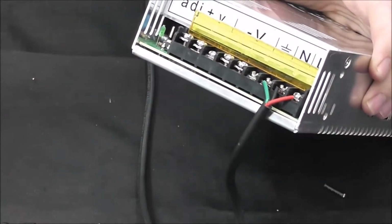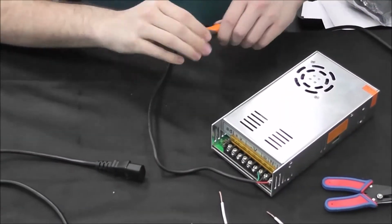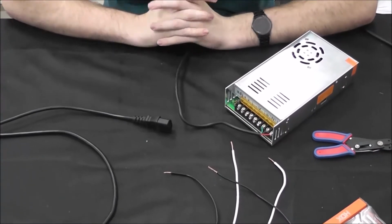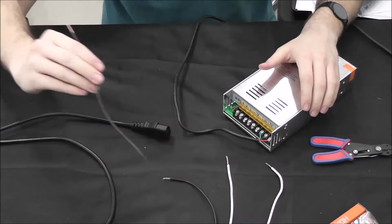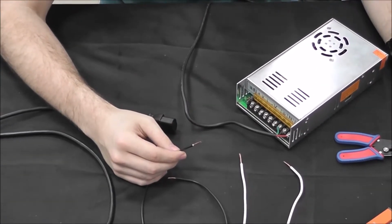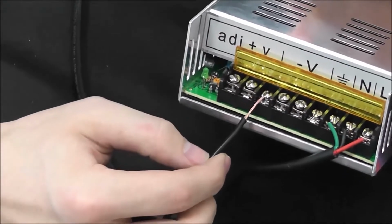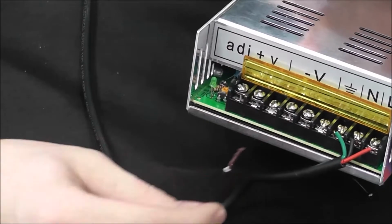Next, we are going to put in the wires that will power the ramps board. You're going to need 2 white and 2 black 18 gauge. The colors don't really matter, you just need 2 negative and 2 positive. But they are going to be cut probably to about 1/2 meter each. And you'll do exactly what you did with the power cable. These first 3 ports here are all your positives, and the second 3 are all your negatives. Now we're only going to use the first 2 of each one though.